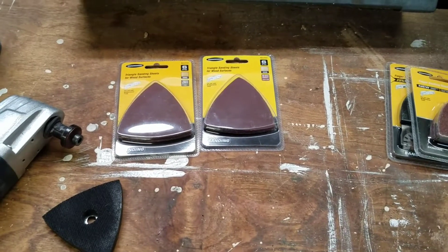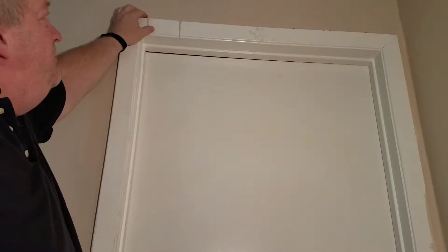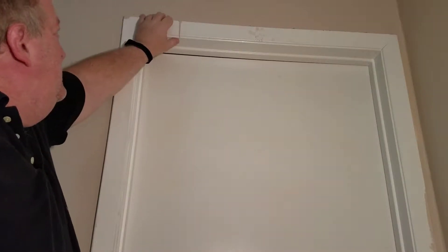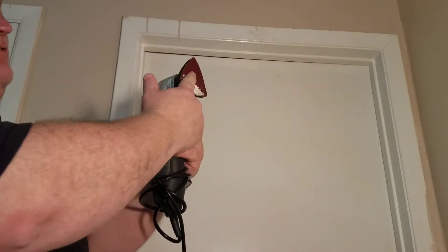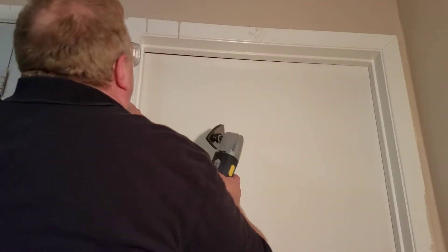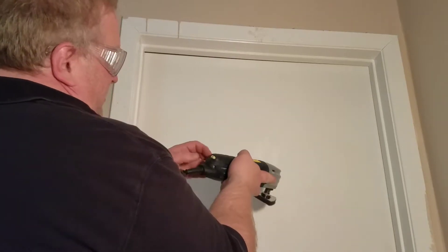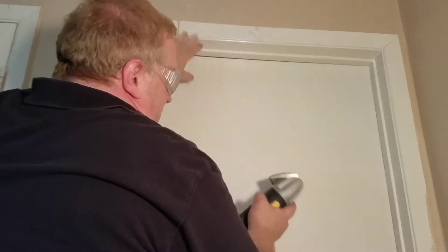And this will definitely do the trick — I'll show you the results here shortly. As you can see, we've had some fairly thick runs on the paint and we need to buzz those down. These areas are too fine for the big orbital sander. We've got the triangle sanding pad on the oscillating multi-tool. Before we use any power tools, we don our safety glasses, lest we end up with bigger problems than just drips in the paint. So we turn it on at variable speeds — I'm going to start at the lowest, then turn it up.